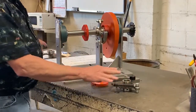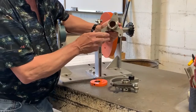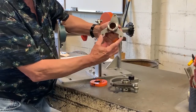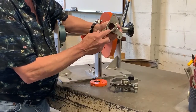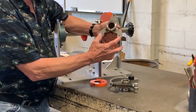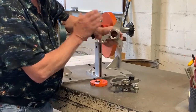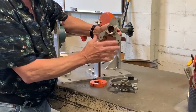I've got another clutch — I took it apart and I've got the arm off of it. This keyway has to be in the center of these two bolt holes right here. All of our clutches are manufactured with the keyway in the middle. I can't speak for anybody else's clutches, but if that keyway is not dead center between these two bolt holes, it's not going to work for you. It'll work in other applications, but it's not going to work on this cam. It has to be dead center.